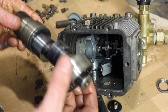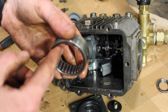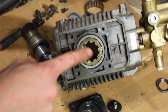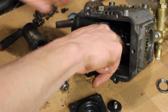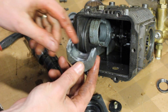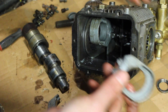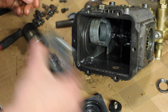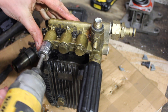So that's our shaft out. There's a nice roller bearing in the end, and there was a larger roller bearing in the far end. The middle rod had broken on the big end as we saw, and the end rod was also broken down lower — though that might have happened when we pressed it out, I'm not sure.